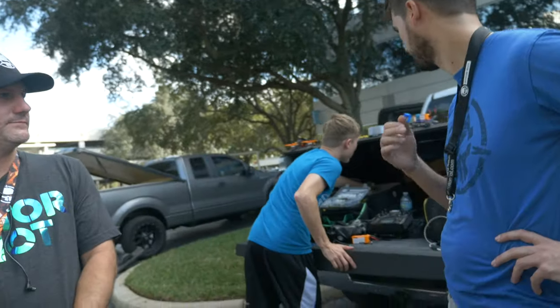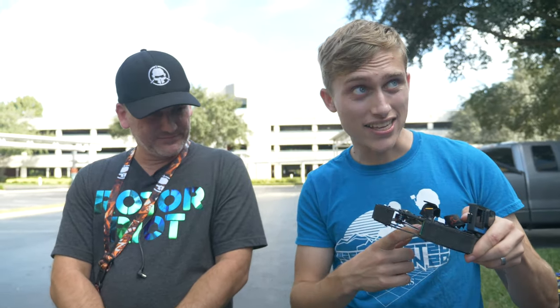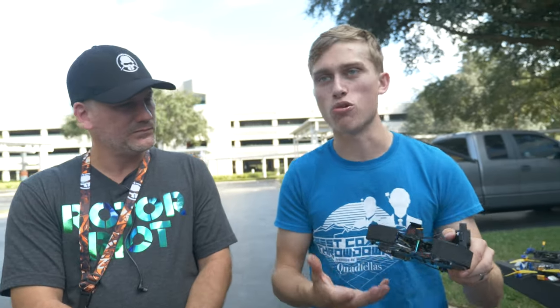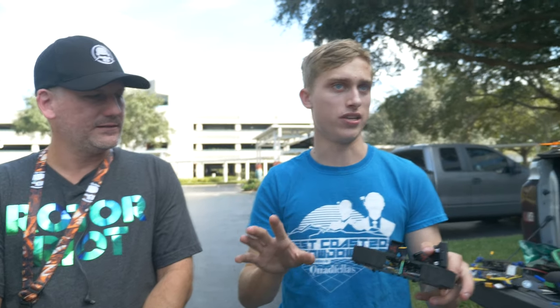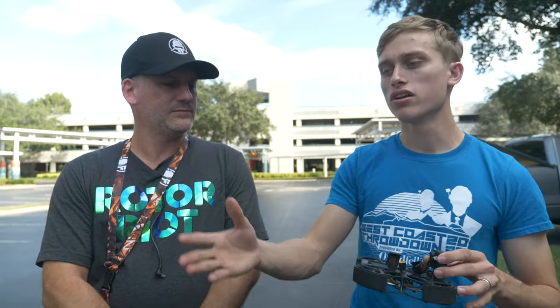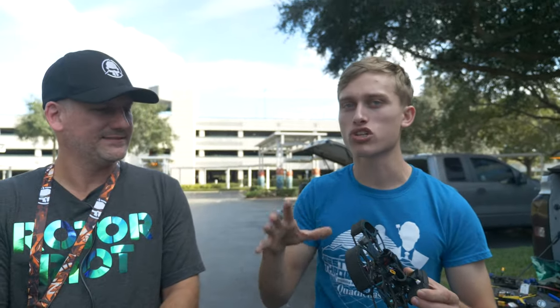What if I did want to throw one of these FCs on a Cinewhoop or even a 2-inch little micro drone? Are there presets in there? Yeah, and there's some really awesome, you guys haven't even seen this yet, but this is the FETtec 326S all-in-one board. It's a 2020 mounting board. This all-in-one I have in my Cinewhoop, and KISS flies incredible on a Cinewhoop. I've tried it on this size. You're probably not going to crash this that hard. They recommend that you keep it on either ultralight 5-inch quads, and I'm not talking racing quads, I'm talking your sub 250. They don't really recommend you push this stack on a 6S, but I've seen some. I went 4S, so maybe you might be able to get away with it, but again, it's really more geared to the micro side of things.